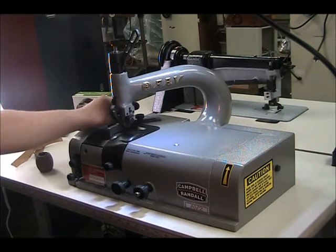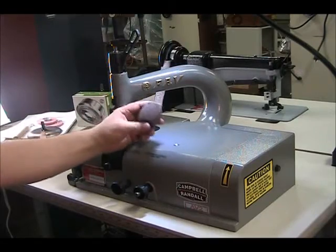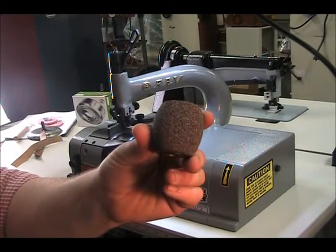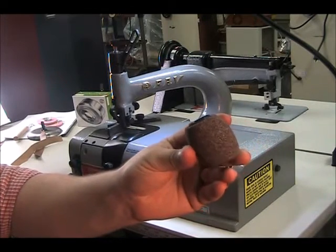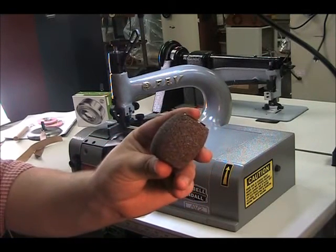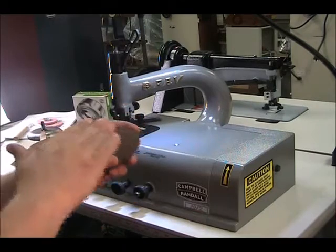Now, this is called a bottom feed machine because the only feed is in the bottom, and that is done through a feed wheel. The standard feed wheel is a stone. This stone is driven by a mechanism in the back. This particular model uses a variable speed gearhead motor to make that happen. And some of your more traditional models, like the traditional AV2, have a clutch mechanism that pulls power from the main motor. It can independently engage and disengage the feed wheel at will. So the feed wheel spins and pulls the material into the knife.